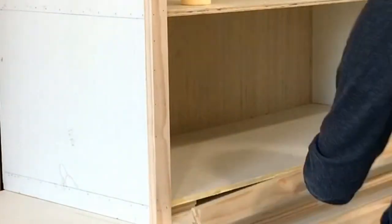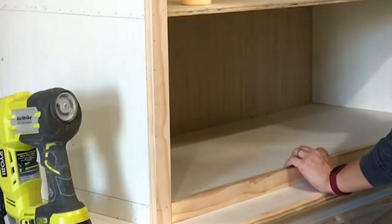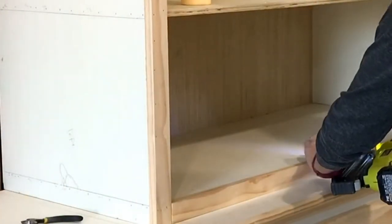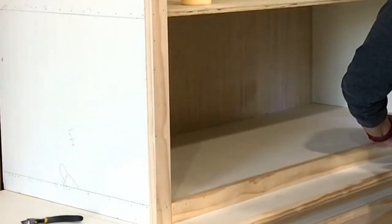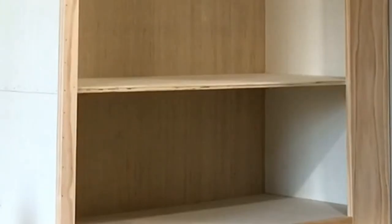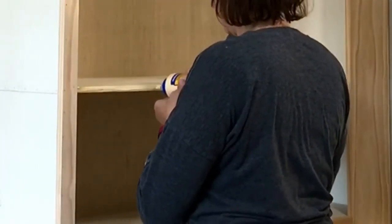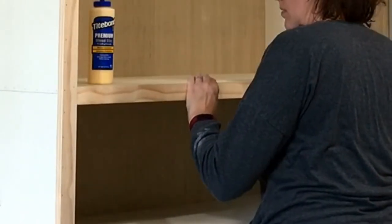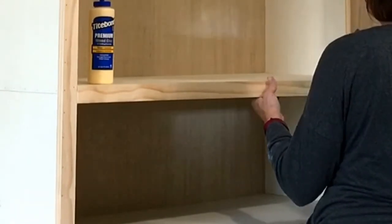Once the side and upper pieces were attached, I moved on to the bottom piece of select pine. I built that shelf an inch and a half up so this piece of select pine fits perfectly lined up with the shelf, giving some space for attaching cabinet doors and leaving a little room along the bottom of the cabinet door before the countertop. When attaching the face frame pieces to each shelf, I use wood glue all along the length and brad nails every few inches so the face of the shelf provides extra support to fight any sag over the years.